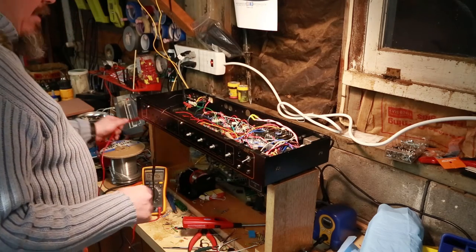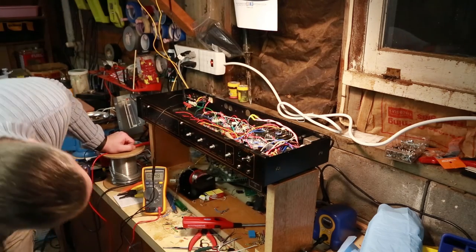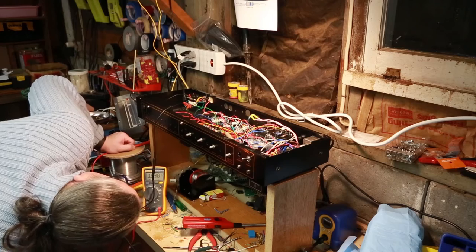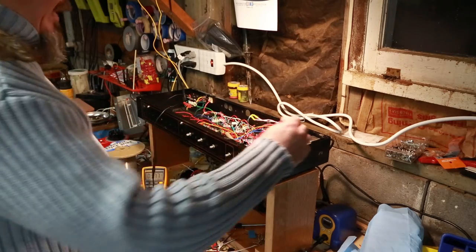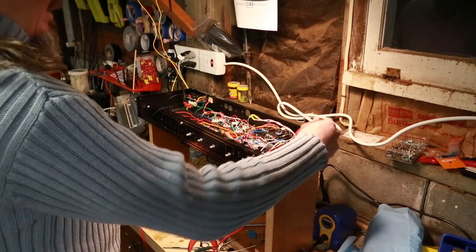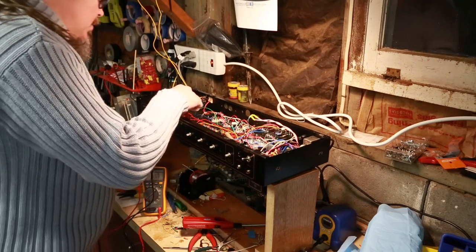So what I'm gonna do right now again is just do a quick power on check, make sure everything looks good. And all of my heaters are glowing. And that's good to go. All right, so at this point, I can check my voltage here, and it's saying it's 118. I don't know if that's readable from your position, but if I go to my voltage here, again on my rail, right here, I am at 302 volts.